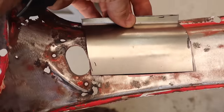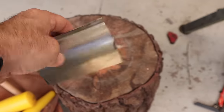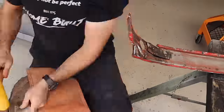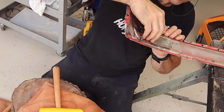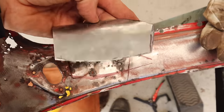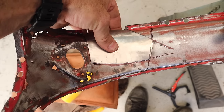This is going to be a much more complicated piece because it curves in this direction as well as this direction — it's a compound curve. So I'm going to have a go at using the stump and some plastic mallets and see if I can bash something close to that shape. This is just a little snapshot of the amount of work and back-and-forth it takes to make one of these reverse curve shapes. I had the fold for the front edge and realized it was going to be way too hard to get the shape with curves in both directions, so I stretched the front edge to keep it curving in all directions. And with a lot of hammer and dolly work, I've got a patch there that's going to look pretty good.